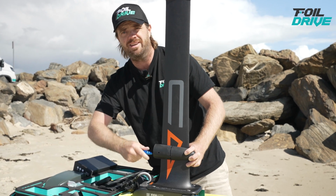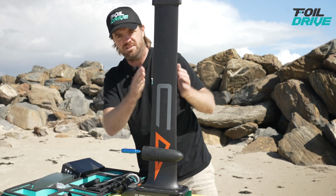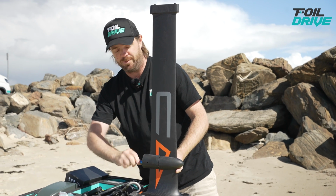It's okay to have a gap between the pod halves. Tapered masts, that is necessary. As the taper goes down this way, the gap reduces. As you push it this way, the gap increases. The gap allows there to be clamping force. If there's no gap, it wouldn't work.